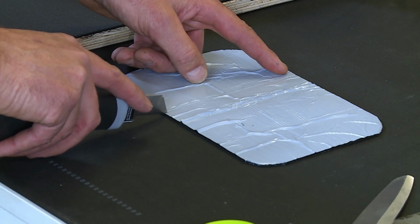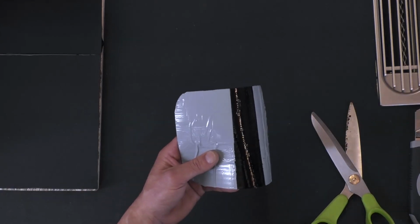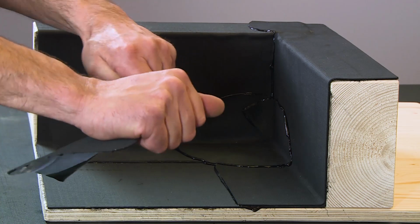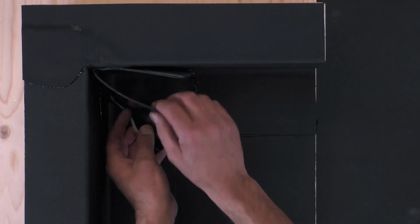The PE film should be cut into 3 sections. The centre section should then be removed. Before placing on the upstand, you should break the reinforcement in the middle, at the top and the bottom. Once in place, leave the tongue 3mm up from the roof surface and then remove the rest of the PE film.